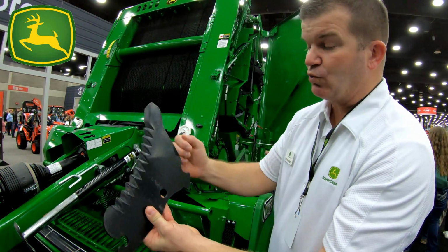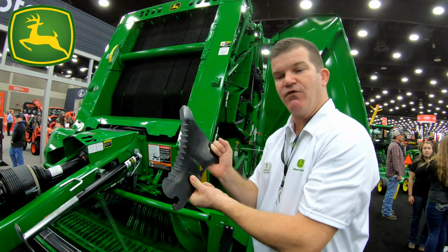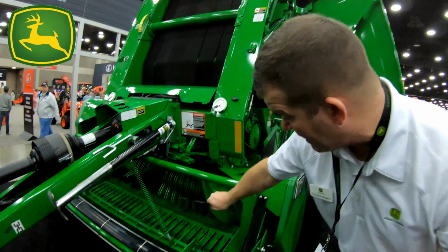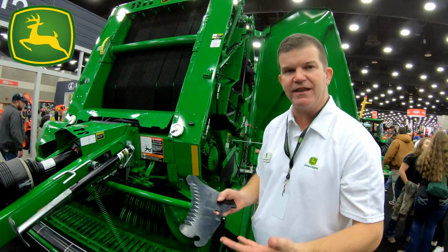When you drop the floor, there's a roller that comes in the backside, locks in that slot, and now you're using a hydraulic force, straight force, pushing that knife through the floor, through those slots on the bottom there to get that knife up through there. It's about 2,700 pounds of pressure to get that knife up through there.